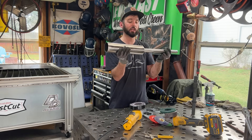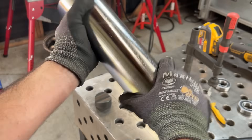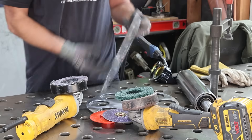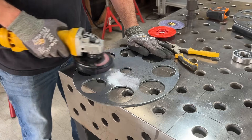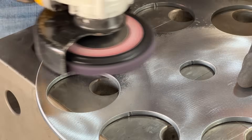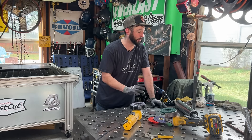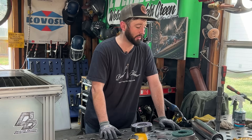The three-inch tube is going to go on the outside so we can make that sucker spin. All I had to do was take the 3M Scotch-Brite pad and it cleaned up really, really easily — same thing with these wheels. I didn't even need a flap disc; just the Scotch-Brite wheel to get that mill scale off the plate. We want the mill scale off because we are MIG welding today and we do want clean welds. If you want nice, shiny, clean MIG welds, you need nice, shiny, clean steel. Now that we've got all our parts prepped, we can step over to the machine.